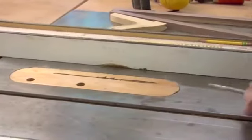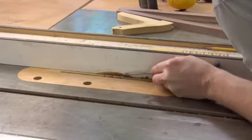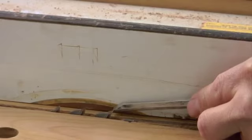At the table saw, set the blade at whatever width you want your pegs to be. In this case, they're about 1/4 inch. You make your life a lot easier if you make pegs that match the width of one of your chisels or just a hair wider.